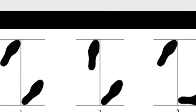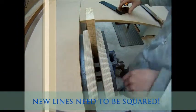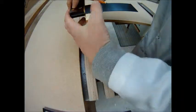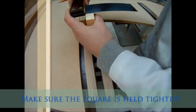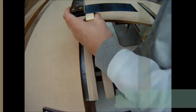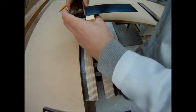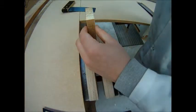Alternate your feet until you feel comfortable, confident, and steady. Try this a couple of times in advance. Place your material in the vise in an upright position, not too high up. Take the square and ensure that it is clamped securely. This particular marking out exercise can be difficult because there is not a lot of material to rest the square against. Ensure that the material is not too high up in the vise because this will also cause vibration when cutting.